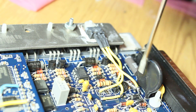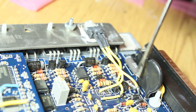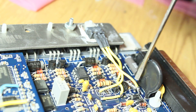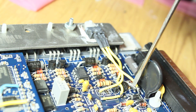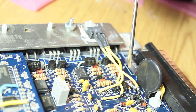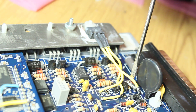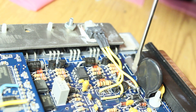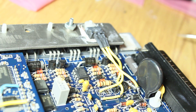The other thing is this flyback diode over here. Since we are going to run an inductive load, it's going to want to spike and put a bunch of noise in the system and maybe damage something. The MS-Extra guide says to put this guy down here, going from D8 to S12 jumper. But the Mega Manual actually tells you to put it right on the valve itself, which probably is better. I think this should work fine, or you can probably do both. But that's it for the TIP120 PWM-IAC.